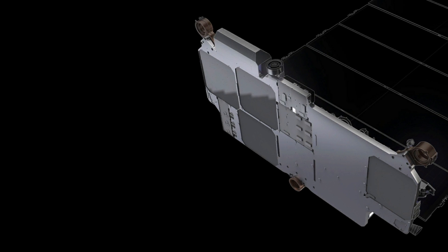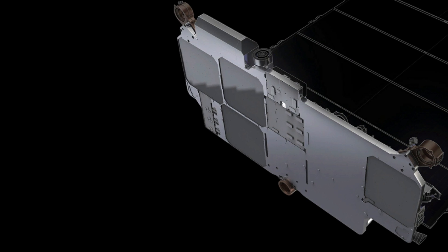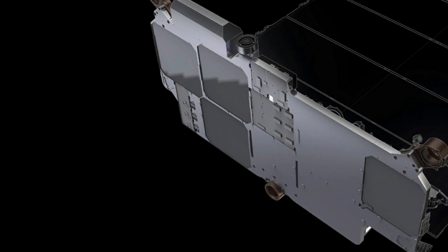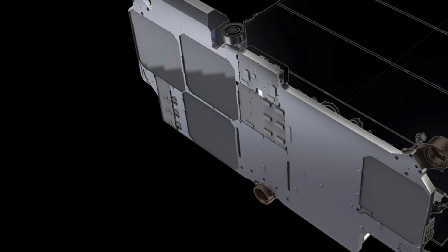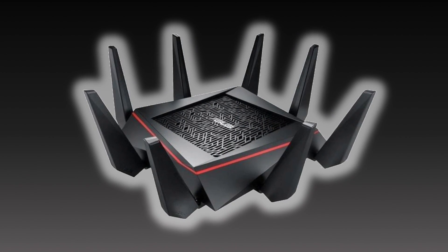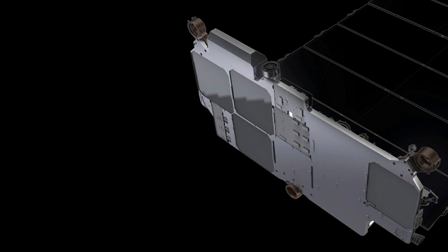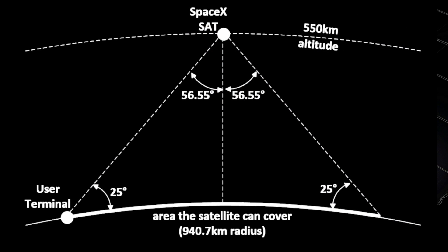This is the underside of one of the first Starlink satellites. Those grey panels are phased array antennas and they allow the satellite to steer very narrow radio beams, so it can communicate with many ground stations at the same time without needing to move a dish around as it passes by at 27,000 km per hour. The same principle is used by modern Wi-Fi base stations, but while they use just a few antennas to focus power in the general direction of your phone, each of those grey panels consists of 100 or more small antennas. They can focus a radio beam only a couple of degrees wide, and can also steer a beam a long way to the side. According to FCC filings, a ground station should be able to communicate with a satellite when it's only 25 degrees above the horizon.